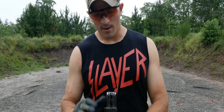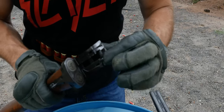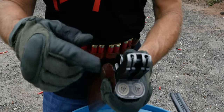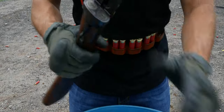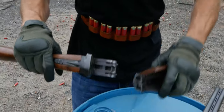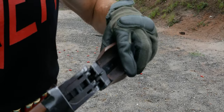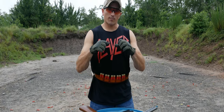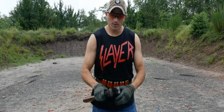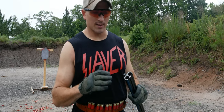I've got the gun broken down right now — forgive that it's really dirty, we just shot about 200 rounds through this thing. Another thing I did was I polished these contact surfaces right here. Usually these are black when you get it, but I just took some sandpaper and smoothed and polished them down. This makes it a lot smoother when it's breaking open. When you get these guns, they're pretty rough and really hard to break open, but if you smooth these areas out, over time they go a lot looser.